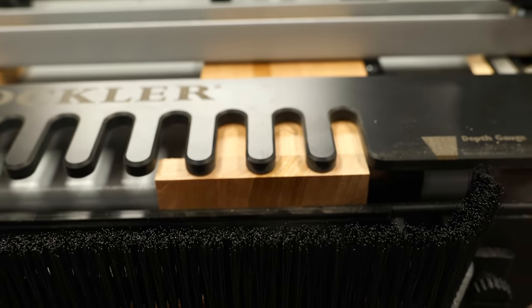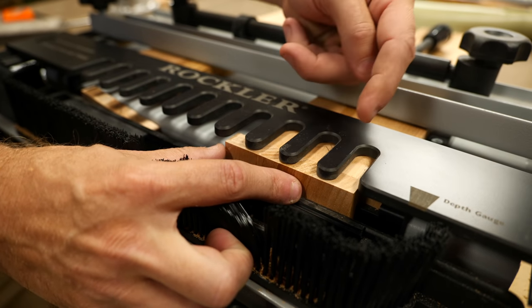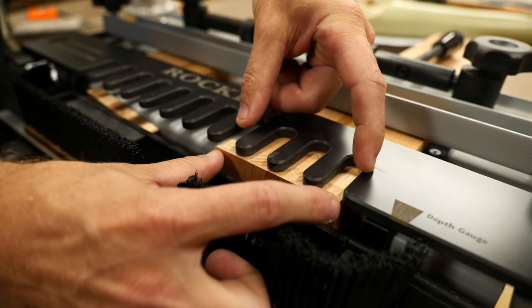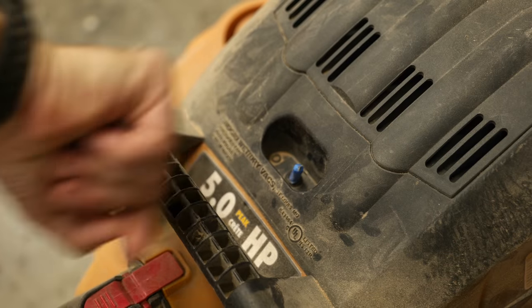The pieces are offset by half of an inch, the thickness of the material, and that's because when you take the router bit through here, you're cutting out this one and this one, leaving a pin right here, so that when they end up lining up, the pin that's here will go into the slot that's being cut right there.